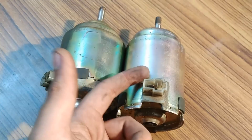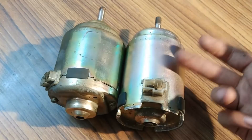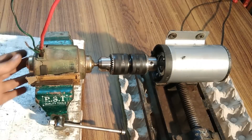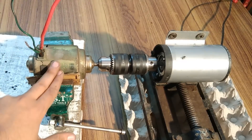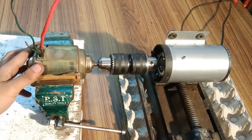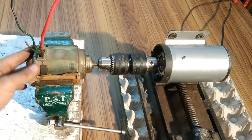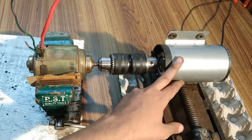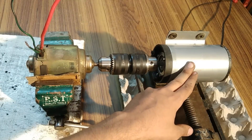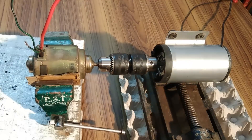Now I'm going to test this one as a generator, since I already tested the other one in my previous video — the link is in the description. The setup is the same: this is a 450-watt DC generator with a current generating capability of 32 Amperes and a maximum of up to 40 Amperes, and this is a 150-volt DC motor. I'm giving it a 92-volt DC supply by connecting a laptop charger and electric scooter charger in series.